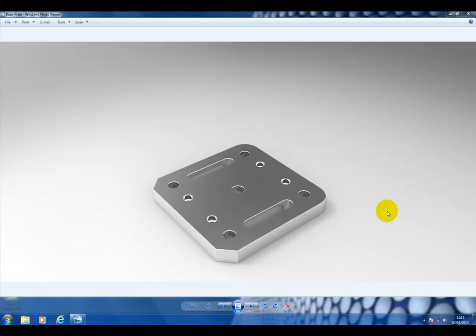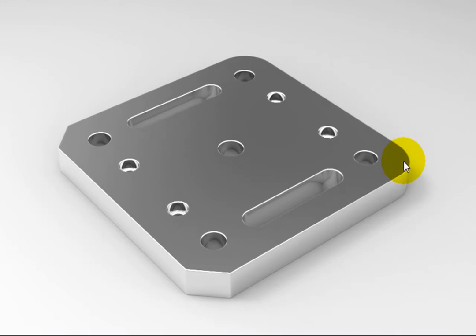This is the bottom or base plate of our press plate assembly. The way we'll model it is to open Creo Parametric, select the working directory, and open the base or bottom plate. The part will open with the four holes already in the corners, the chamfers and the rounds on the corners. We will then put some of the other features onto it: we'll start with the centre hole, which is a simple 9.2mm hole straight through the part. We will create one slot and then mirror it around a centre reference plane, then do the four counterbore holes using two separate extrudes — one through the part for the thread and one for the counterbore to allow space for the cap head screw.